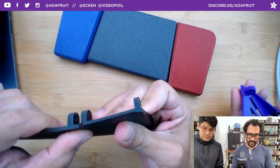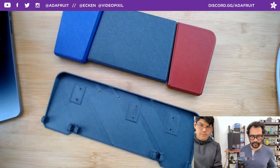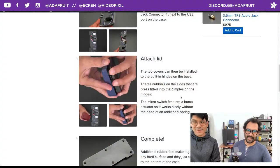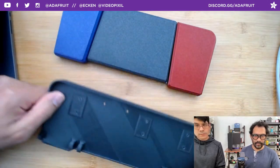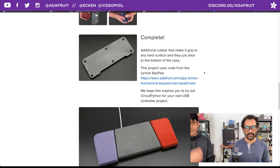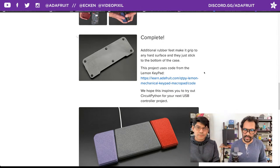They flex in and out so you can attach the divots. You're not going to be taking it apart often — just showing the strength of the PLA, which is that glittery PLA. Don't forget the rubber feet — you're going to need two sets. I had it with just four feet but the center is so long that it will deform every time you push down, so add two extra feet in the middle and you should be set.